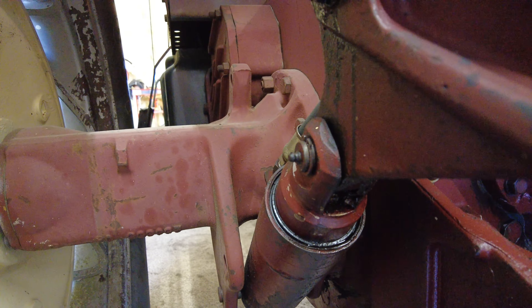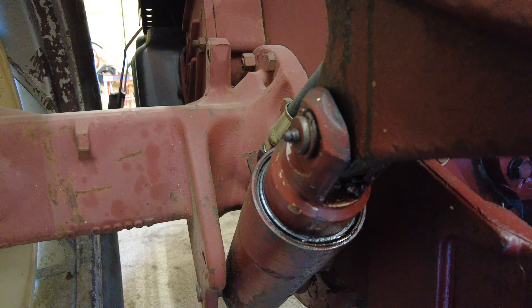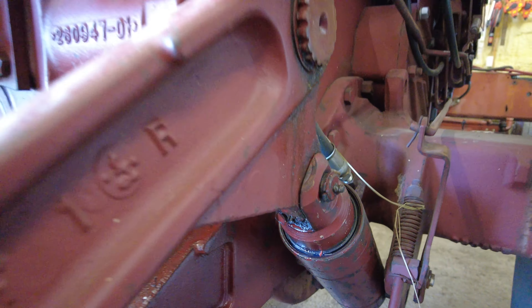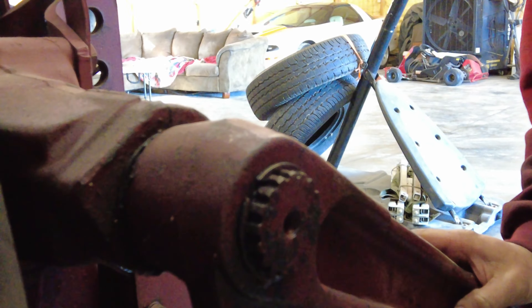The other thing is, if you can't tell, both of these hydraulic cylinders for our three-point are weeping — they're both seeping, leaking quite a bit. The three-point won't stay up more than a few minutes after the tractor gets turned off. So we're going to get those rebuilt. I'm pretty sure you're going to be able to see this right here — it's just a little retainer ring we're going to pop out.